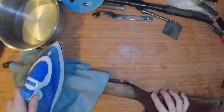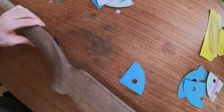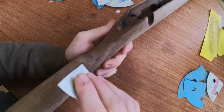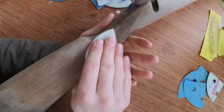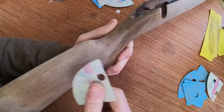I left the stock to dry naturally for a couple of days before I started the sanding process. Using 400 grit sandpaper I sanded the entire stock inside and out. 400 grit is coarse enough to work but not too coarse to leave scratches in the wood that you'll see later on. This also leaves a very smooth finish.